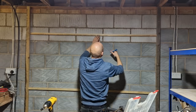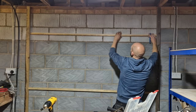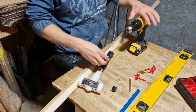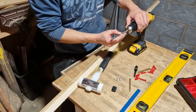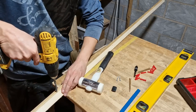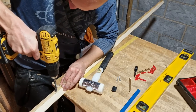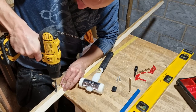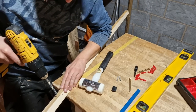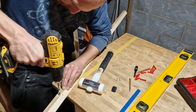Unfortunately you don't get to see that great idea, but it was fundamentally the same. With each length of wood, I marked the holes I was going to drill, drilled through with the wood bit, then countersunk where the screws were going to sit. The difference is I didn't have to do any pre-drilling into the breeze block wall. I used concrete screws, which I had left over from fitting our triple glazing earlier this year. These things are amazing — they self-drive straight through the concrete and are just bombproof. The right-hand side was much stronger than the left, with zero wobble and much less than half the effort.